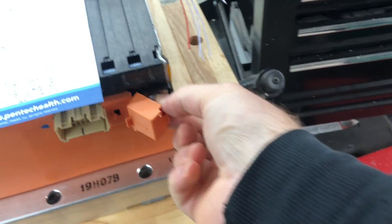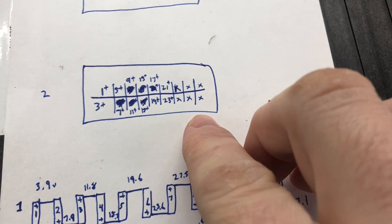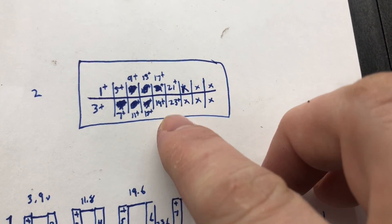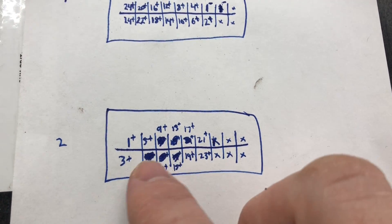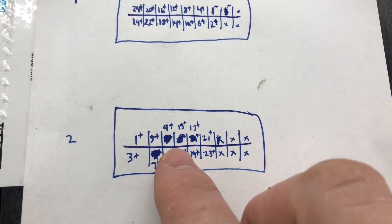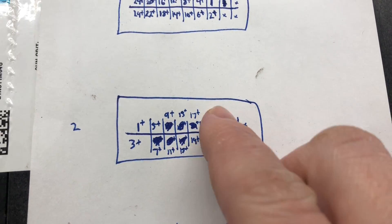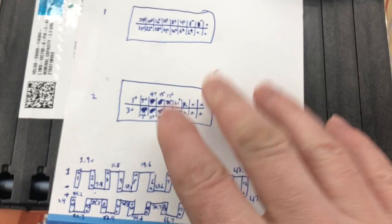On the other side, I left my multimeter negative screwed onto the terminal and started probing port number two. I found that all the blank ports were clustered on one side — six blanks — and then I started seeing one positive, three positive, five, seven. I actually skipped a pin and started labeling it wrong until I realized my mistake, so I had to scratch those out. Then seven positive, nine positive, 11, 13, 15, 17, 19, on down the line — 23 positive is the highest odd number. I was able to map all of those out.